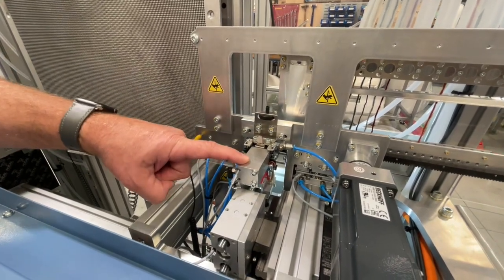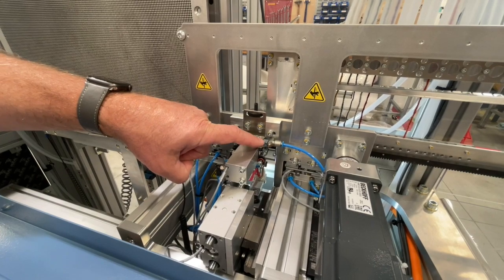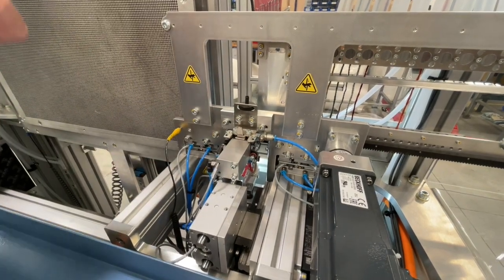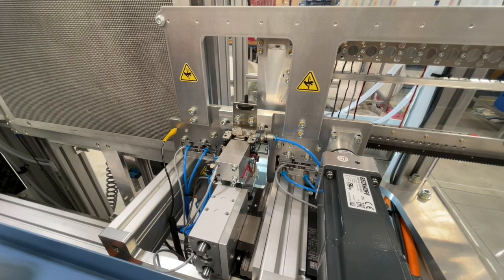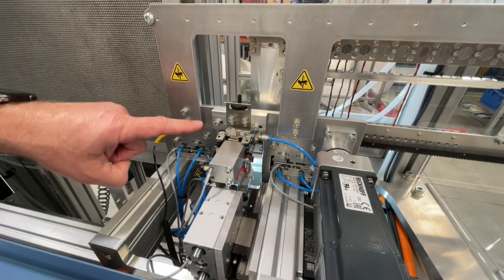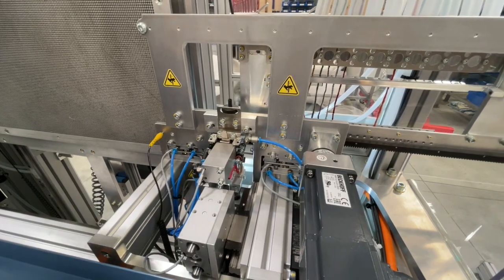We've made many changes to the cutter. The big change is adjustments to the in-out position independent of the screws to remove the cutter. That means you can take the cutter off, make adjustments and maintenance, put the cutter back on, and it will be in the same position. In addition, we have a knurled wheel here that we can precisely change the cutter position up and down. The benefit of that is that we can set the U-shape of the tuft very precisely.